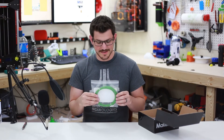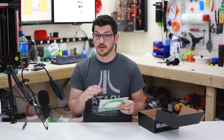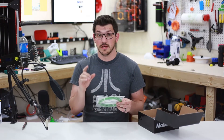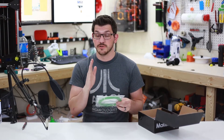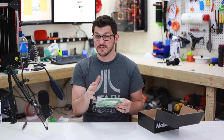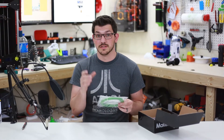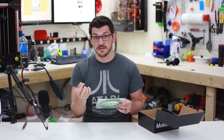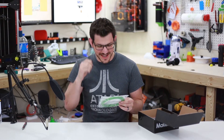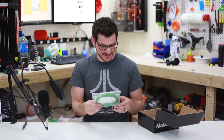Now we have Phoenix Nylon from Bree3DP — I've never seen colored nylon before. If you're printing nylon, you have to print it hot: 240–260°C on the hot end. But be careful — if you have a PTFE-lined hot end, at 250°C it begins to break down and melt. You're going to get a clog and an unusable throat because it'll just be a melted glob of PTFE. Bed temperature 60–80°C, speed 30–150mm/s. That 120mm/s range is crazy wide.